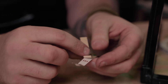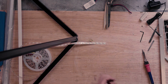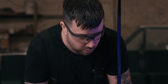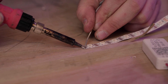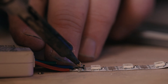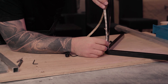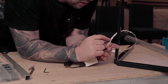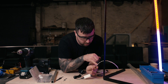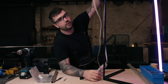I've peeled a little bit of adhesive off the back of the strip — it's a little tip I use that lets me stick the strip to the bench while soldering so it doesn't move. All I'm going to do is put a little bit of solder on the contacts here to make it stick so much easier. We've now soldered our controller onto our strip, and all we need to do is work out how long the strip needs to be. You can only cut the strips where the copper contacts are. The WS2812Bs can be cut every single pixel, so I'll roughly look at how much I need and cut with scissors.